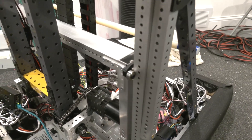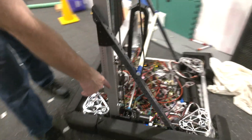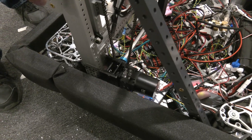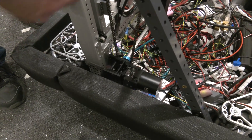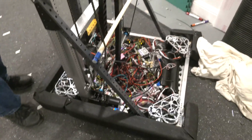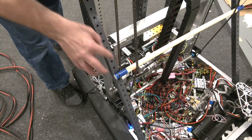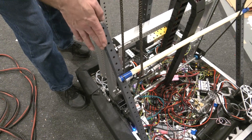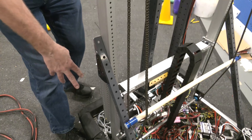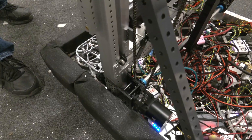You'll see the primary drive system for the elevator — come around the back side here. There's a single Neo driving through a 4-to-1 and a 5-to-1 REV gearbox going through a right angle drive. It simply has a shaft going across with a sprocket on each side, runs up top. We're doing some chain tensioning with a nylon rod fastened side to side. You definitely want to brace your elevator — just attaching at the bottom is not going to be enough, so make sure you brace it.